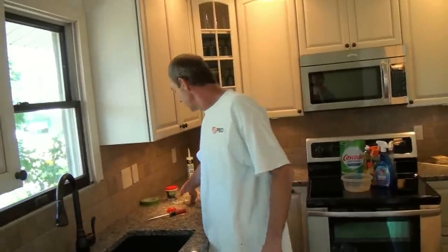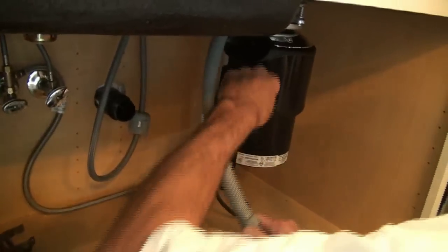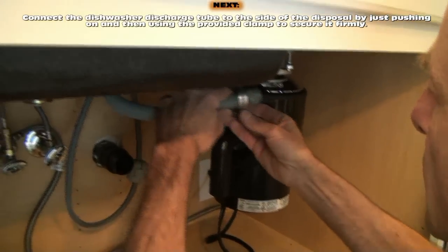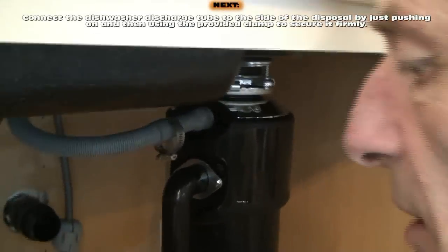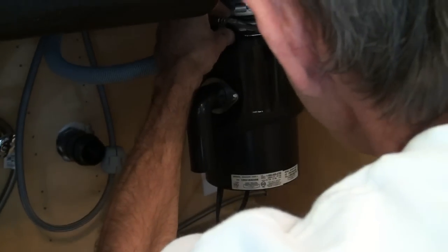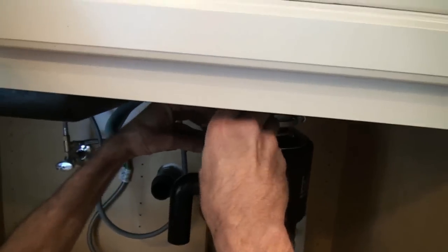By the way, I've got a hose clamp here. This is our dishwasher discharge — it's coming through the side of the cabinet. We showed you how to do that in the appliance video. This just plugs onto the disposal inlet and gets connected with a hose clamp. All the dirty water from the dishwasher is going to come blasting out of that hose into the side of the garbage disposal. All the wastewater from a dishwasher goes through the garbage disposal.